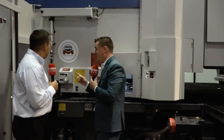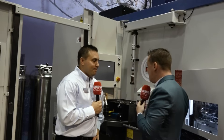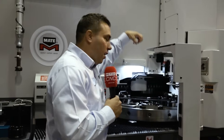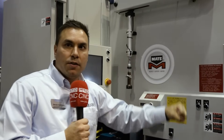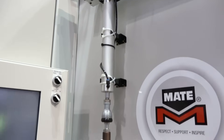Some of these components are quite heavy. There's something just over your left shoulder worth bringing up — and I didn't want to leave this area just yet because I can only lift about five or ten pounds. This is a standard feature called a tool lifter, or tool balancer. Basically, when you get into these larger tools, as most operators know, they're heavy to lift with one arm coming out of the turret. This is air-driven and it gives you a chance to bring that arm down, attach it to the top of the tool, lift it up, and now you're saving your back, your neck, your shoulder — making the operator not hate his life.